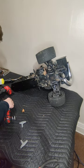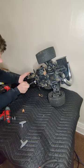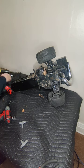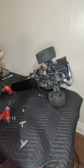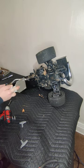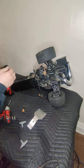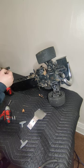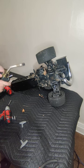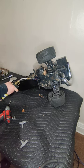The tighter the fit of the Allen head, the better you're going to do. Listen, sometimes you got to tighten a bolt more than... I set that down on the damn thing. I said, sometimes you got to tighten it a little bit before you loosen it, because that's how the screws and bolts get. That's after you heat them up. It could be anything, but I think this is just because they use a steel bolt and aluminum, and it's probably corroded. More than likely. I'm going to heat it up a little more. They always make them where you got to spend money somehow. Unless you know what you're doing.